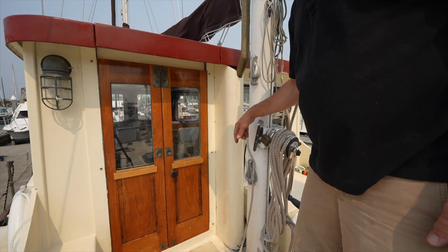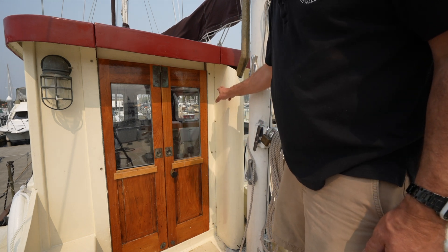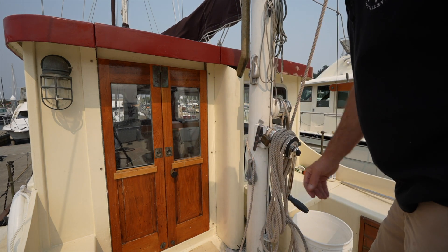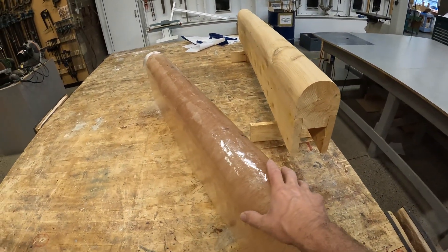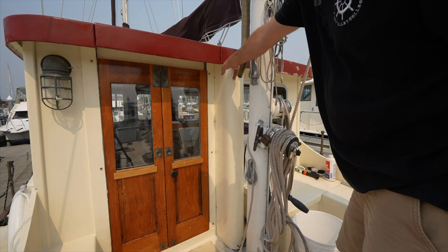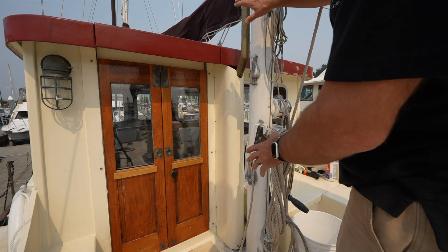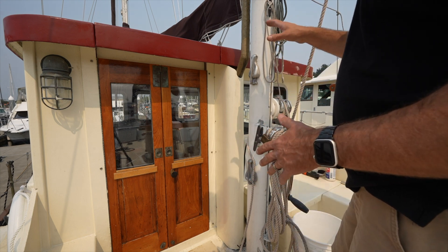Side note: it comes up through the engine room and goes through the head, which is under a covering board. Where it comes up through the deck, that's hard fiberglass pipe. We put a short section of two-inch flex hose to attach to the rigid part, since it would be too hard to build it all in one. Mike Switzer made a really nice mold out of a piece of wood in his shop, brought it in one day while we were working on his engine, and did a layup over it — made a nice little fiberglass covering. On the backside, it made a great place to mount my Dan Buoy, my man-overboard device. There was just enough space to run the pipe up, cover it, and paint it to match. We were quite pleased with that part of the installation.